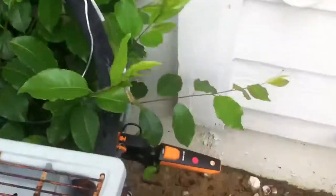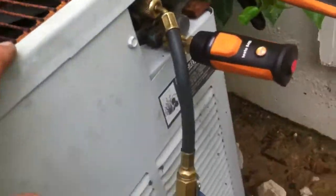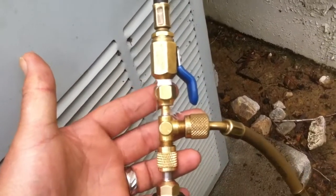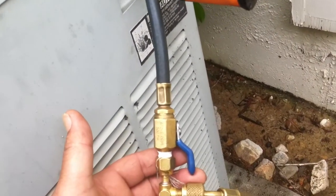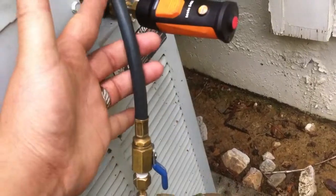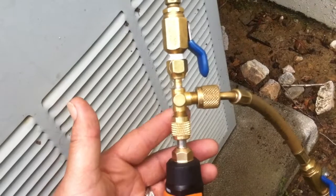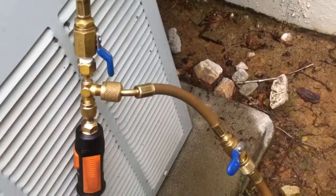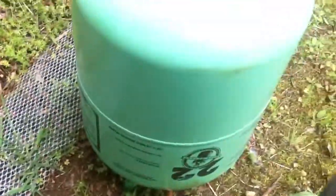As you can see I got my temperature clamps and I got my probes. What I like doing guys is I like using a T, and I'll use a 6 inch hose with a ball valve at the end. On that T you can see one side here I got it tied into the system. The other side of the T I got it hooked up to my probe — in this case my Sporlan probe. And then on the third T over here I got a ball valve and it's hooked up to my drum.